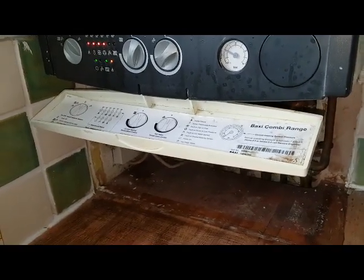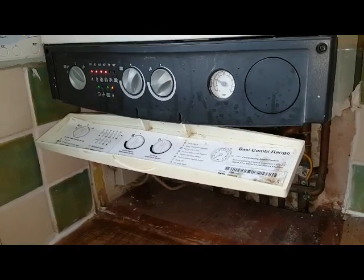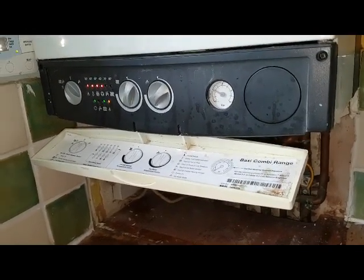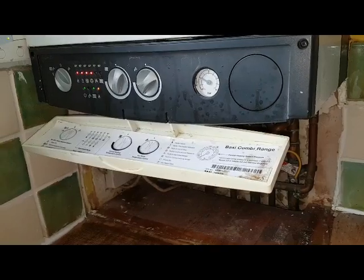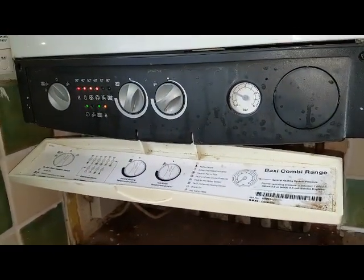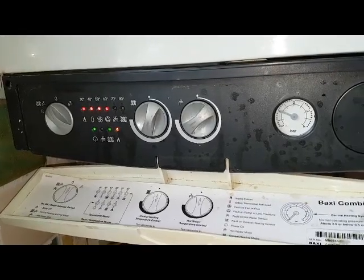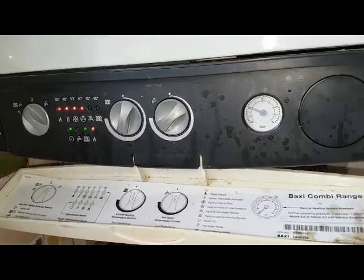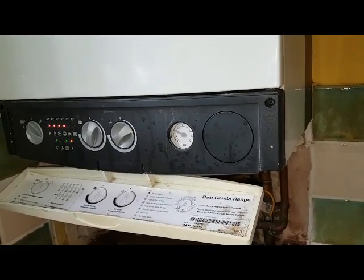They don't sound as bad now. There's a little bit of kettling but I'm not going to be too concerned — it's an old boiler, so it's nothing out of the ordinary. What we had before was extraordinary — we can't have that. It's definitely better now. Before you could hear it within seconds of starting; now it's calmed down and the temperature is stable at 60, not shooting straight up to 80. So I think we've cracked it. Sounds a lot better — you've done it again, diagnostic genius!